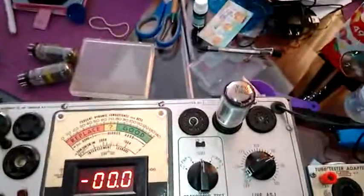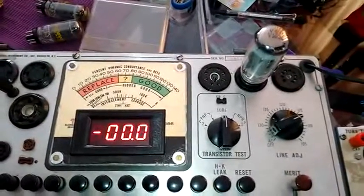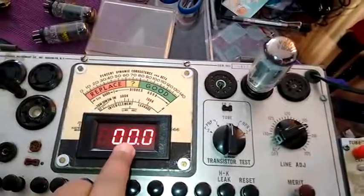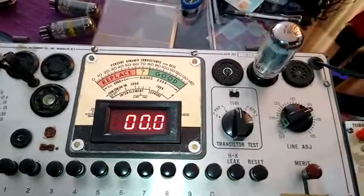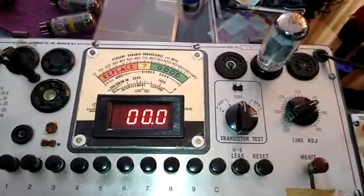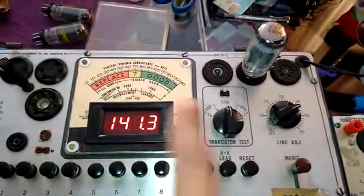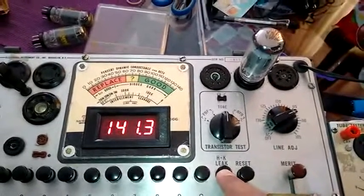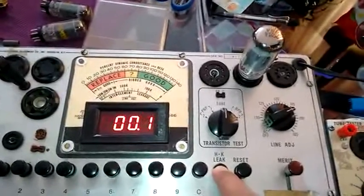I will wait a little bit to warm up the tube, but at this moment I can see if any leak appears on the tube. For number 3, it must stay the same — if you increase the value here and it shows going up, that means a leak is present in the cutoff of the tube. For number 4, still the same, regarding grid number 1. The other one — if it shows going up — the test is to see if any leak exists regarding grid number 2 and the plate, which is very important because it is the control voltage for the tube. Going to 0 shows the tube is healthy.